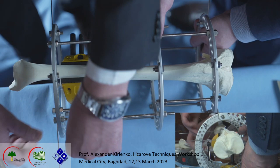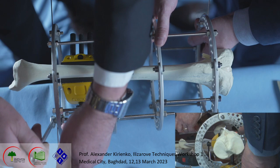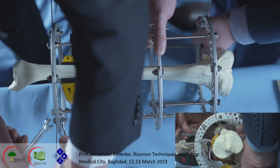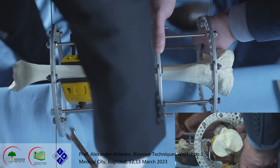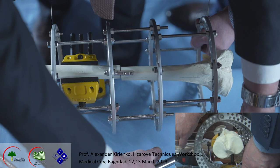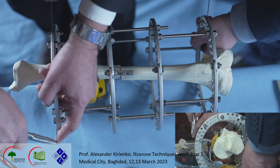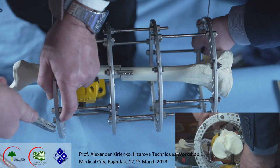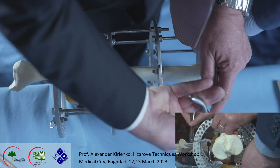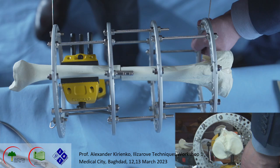Okay, and I tighten one part like this. Okay. What we do with this part, if there is a tip, you should be careful. Usually I cut it from one part here and we bend it. Somebody wants to break it, we'll see, but for now we do the classical way. We bend it this way. Three steps, which I use: one time you do it 70 degrees, second 100 degrees, the third you go inside. It will be positioned on the bolt in a way that this wire doesn't disturb other holes.